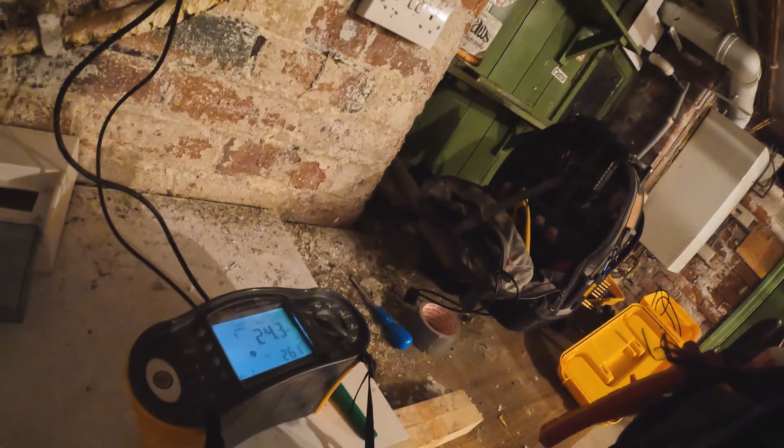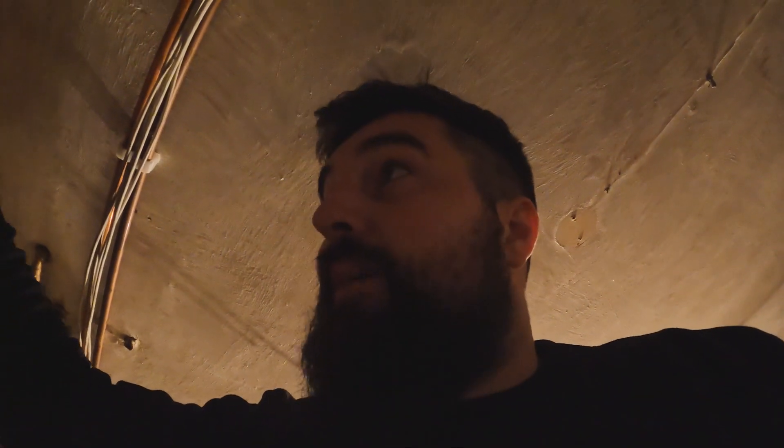Just back down in the basement - let's get these leads attached and find out if that is the culprit. With that cable disconnected - it could be water in a light fitting since it's been quite rainy the past few days; sometimes the seals go under light fittings and water just gets in. Let's test this: earth to neutral - 26 megaohms - that is a brilliant number when you're wanting to get over 1 meg. And then 22 megaohms. Right, we'll bank that back in and see what isn't working.